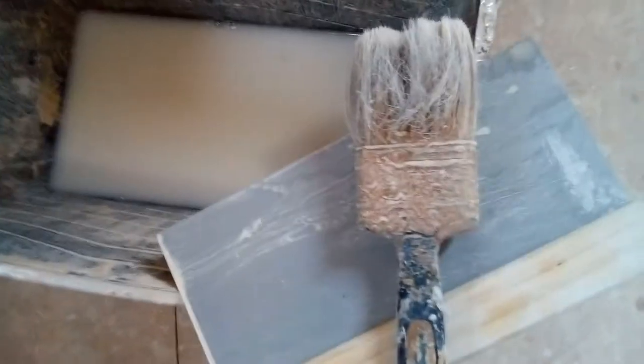So now what we're going to do is lace this back and flatten it out slightly to try and blend in the pattern. Also, we're going to use a damp sponge to blend in any overspill of pattern that might look out of place. We need a bucket of water, a sponge, a flat edge like a corker or a plastering trowel, and a water brush.